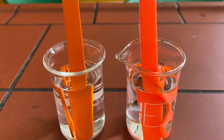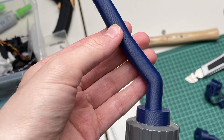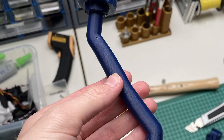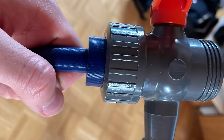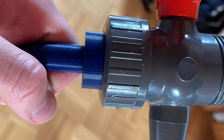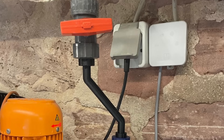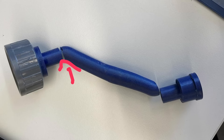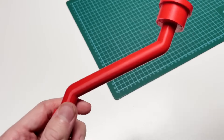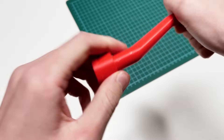Another exciting property is chemical resistance. A few years ago I had a project that involved printing a connecting tube for hydrogen peroxide supply. The requirements were chemical resistance on one hand and sufficient strength on the other, as the tube was attached at two ends with tensile forces acting in basically all directions. The second requirement led to the failure of the project, as prototypes made of PLA and ASA broke — the weak point was the layer adhesion. Looking back, I am pretty sure that this pipe would work with PP, which is why I gave it a try and printed it out.